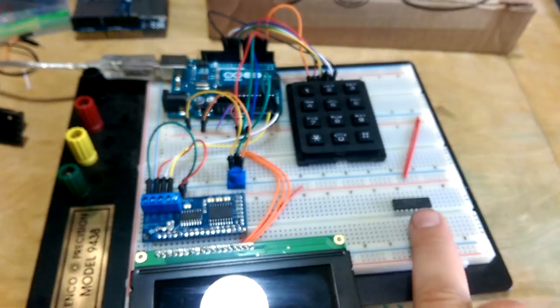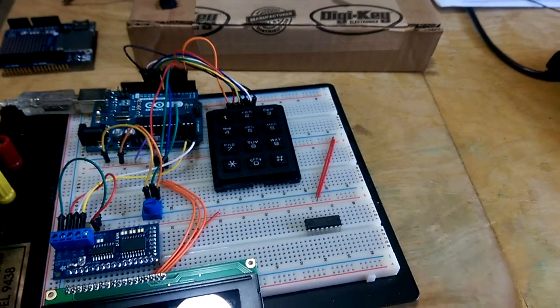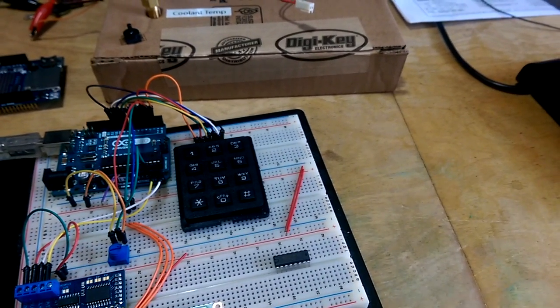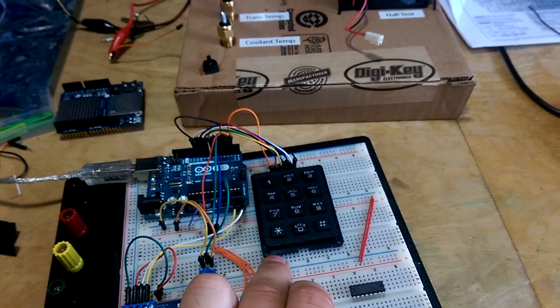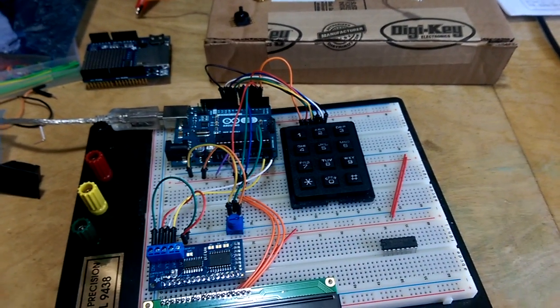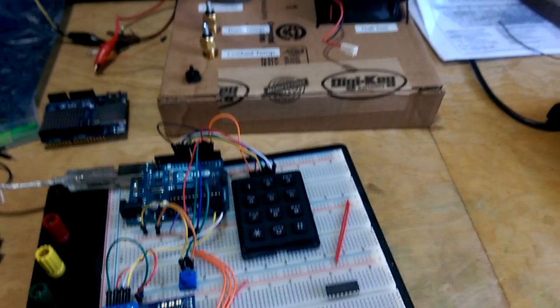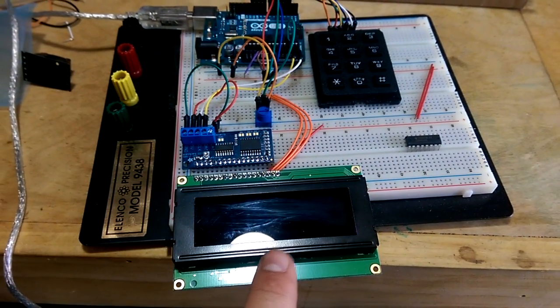All these sensors are going to be hooked up to a multiplexer, because most of them are just measuring analog voltage through voltage dividers. I will probably also hook this keypad up through a set of voltage dividers so it can only use one analog pin. So that's basically the summary of the project — all these sensors are going to display the data on this LCD.